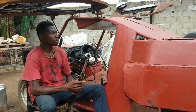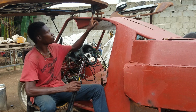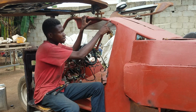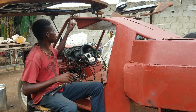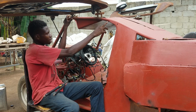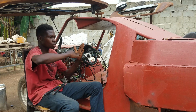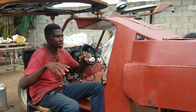One of the reasons why this door actually needs a very long shock is because of this gap that we have here. I have this shape here, and while putting these hinges, I did not follow the design of this shape. If I followed it, it would be straight here and then I'd be putting another one going down like this, and it will affect the opening of the door. Let's say this door is opening at a very straight angle, if you form an angle, it will open differently, which I don't like for a door. So I like it straight.